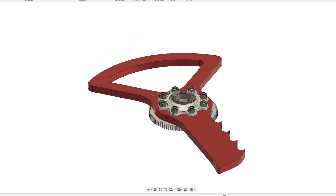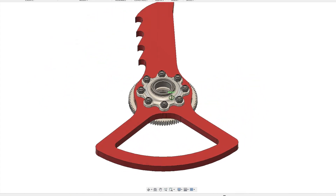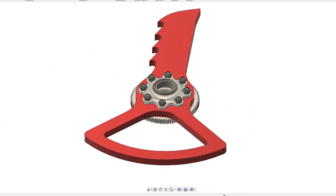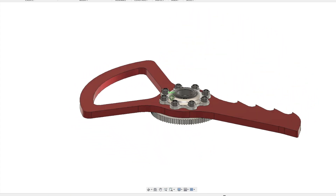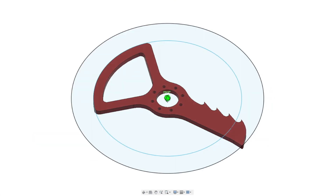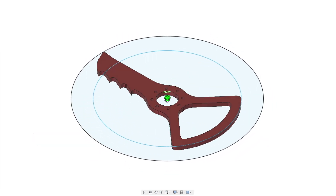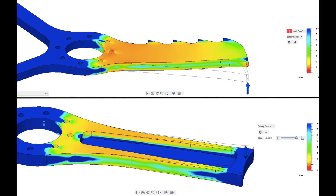So that partially explains the shape of the Key. One tooth means we have twice as much time before the next tooth pass, and the end tapers off to make it a smaller target. The Key has a few other features to help it hold up. It's one inch thick solid S7 tool steel. The tooth is rounded and shaped less aggressively, and it's short. The spin circle is only 40 inches in diameter, making any bending loads smaller.